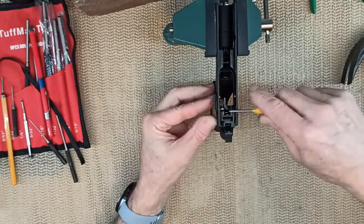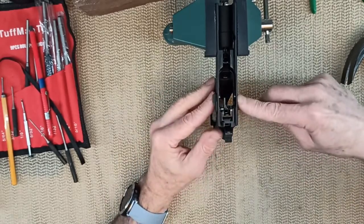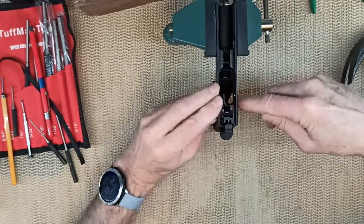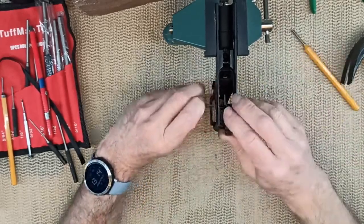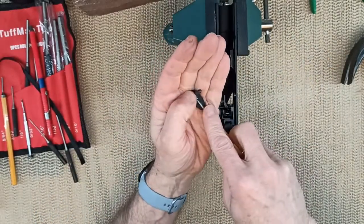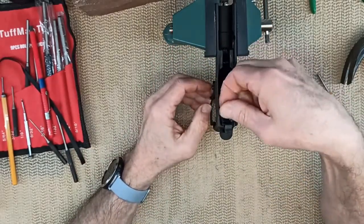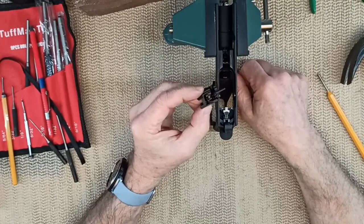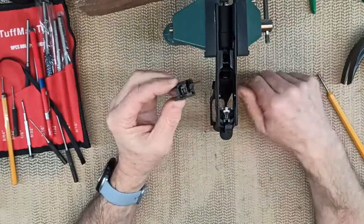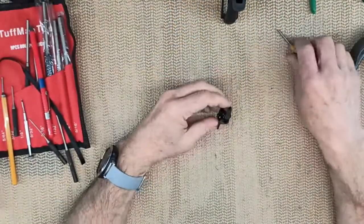And when you push it, you're going to push the safety out, and the pin will take its place. Well, or not. It's out. And this is a safety, and we'll talk about that little detent in a few minutes. All right, here is the sear carrier, sear and spring, three parts. We're going to take it apart right now and rebuild it, because it's so darn easy.